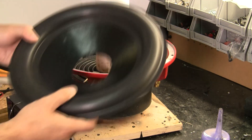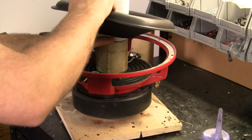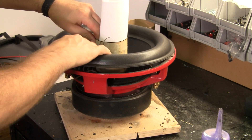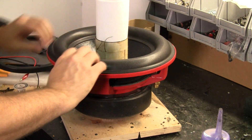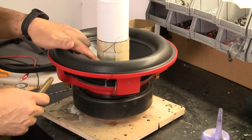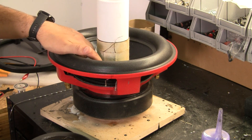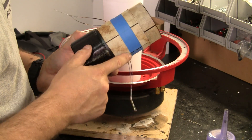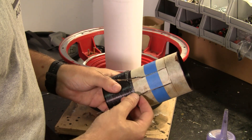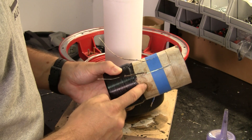With the coil in place on the spiders and lined up, we can slide the cone on and see how far we've got to go to mark it so we can take it back out and cut the former to the appropriate length. Make sure when you're pushing the cone down that you don't move the spider, since we have not glued it yet. With the cone in place we can mark this — we have to leave enough space on top to get a glue joint in, but not so much that we can't clear the inverted dust cap. I've wrapped tape around it for a nice clean straight line, and I've pulled the leads all the way back so we don't cut through them.